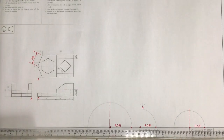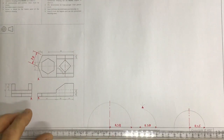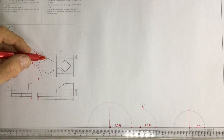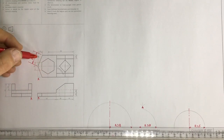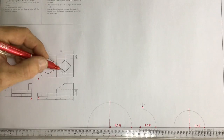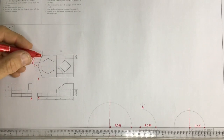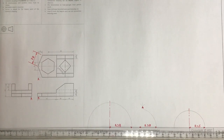We're going to be looking at doing the isometric view from these third angle orthographic projection views. We're going to start by looking at how to draw the auxiliary views. You'll see they've got a number of hexagonal shapes — there's a small one and a big one on the outside, and they've got that square. They left out the measurement of 38 for that side, so just change that on your drawings.